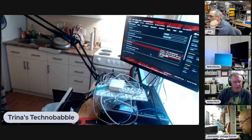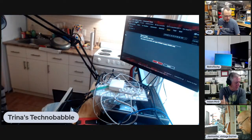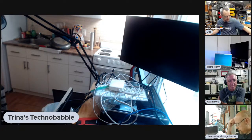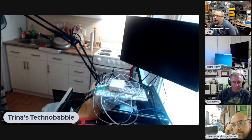I wonder how it works on the 2E then, because the 2E doesn't use 12 for anything. It probably has a built-in capacitor on it, or it's built better. Newer supplies, like the Reactive Micro, you can run them unloaded, and they're all right, because they got around that. The early 2Es, though, have the exact same power supply as the 2 Plus and 2, and those use 12 volts for the RAM. Weird. Maybe they just didn't care. Maybe it actually isn't a problem.